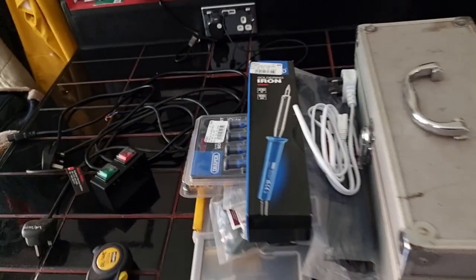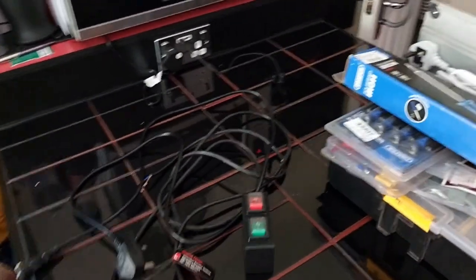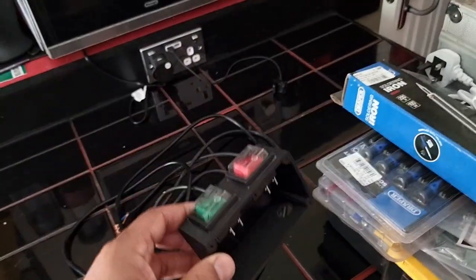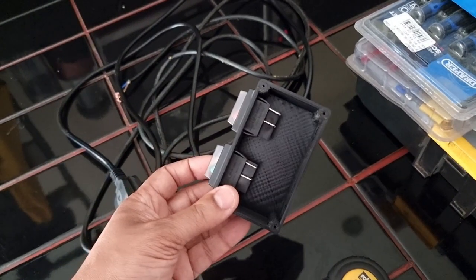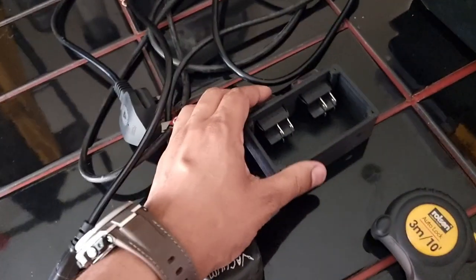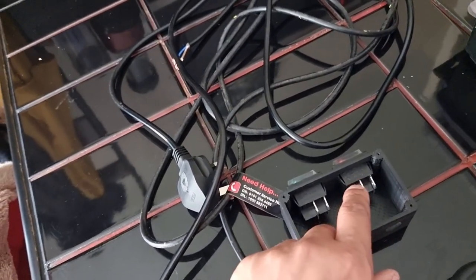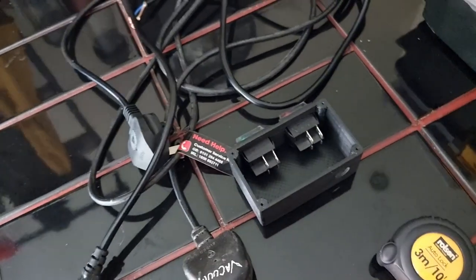Time for some pro wiring - break out the old wiring paraphernalia. What I need to do is sit down, measure out the wire lengths I need. This bit goes kettle lead in, this goes to the printer. I measured I need 700mm from the end of that plug back, and that will wire from the printer into the 3D-printed box. It goes through the side wall of the enclosure into the wiring box, and I'm going to run the power lead from the socket up and into the bottom of there, through the switch. That's the power switch, and that will be for the light. So the wire cuts into this switch and when that switch is on it will turn on the power, and then basically the printer will be on and the power to the light switch will be on - it will all make sense when it's all in and running.